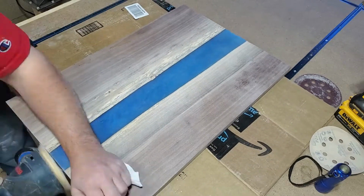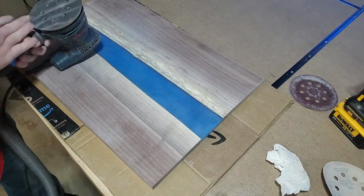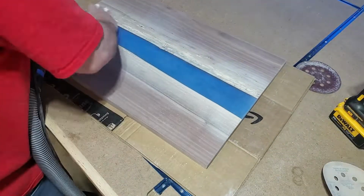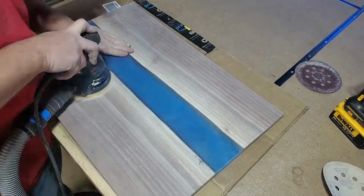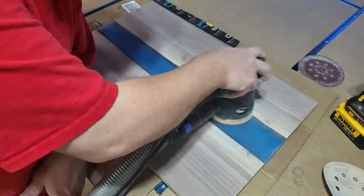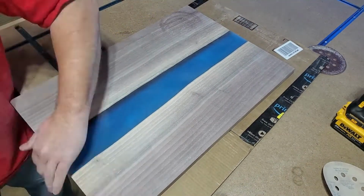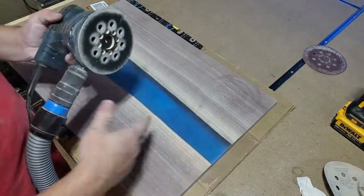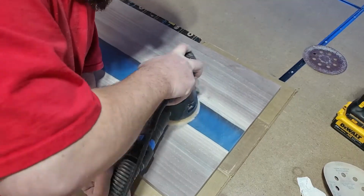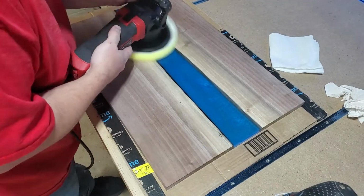It may be, I don't know. It almost seems like we're rubbing a piece of cardboard paper on it at 10,000 grit, but it seemed to have made a difference. But I think some other people stop somewhere around 7,000 grit. I don't know. Let me know in the comments below where you go whenever you do an epoxy project. I did end up catching myself going ahead in sandpaper a couple of times, a little bit faster than what I should have, and had to step back two or three coarse grits twice, basically to solve some little bit of sanding marks from some lower grit. So this definitely took a considerable amount more time sanding, and then required some polishing after the sanding as well.